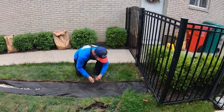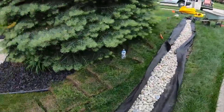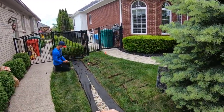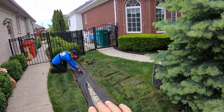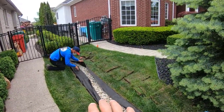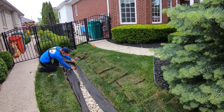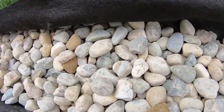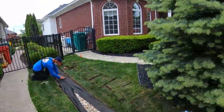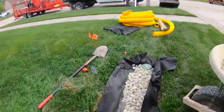Valentin went ahead and removed all the clay — water would be trapped right between the two houses. It's just too flat; even if there was a little bit of slope, it's not enough to get the water out of the turf grass. So when you dig out all the clay and replace it with 14 inches by 14 inches of stone — we like the inch and a half round rock because it creates more void and moves more water — then we get to the point where we have some fall at the discharge end of this run.